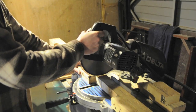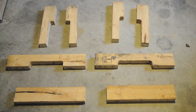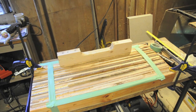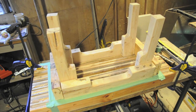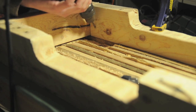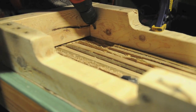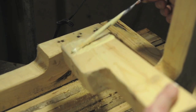While the first coat dried, I started working on the legs, which are made from the 2x4s inside the pallet. These pieces are grooved so that a forklift's arms can reach underneath the pallet and pick it up, and I wanted to use these grooves in the design of my coffee table. Once I placed out the pieces, I drilled a hole through the piece into the coffee table to make sure it wouldn't crack once I put in a screw. And to give extra strength to the legs, I glued them and then screwed them in.